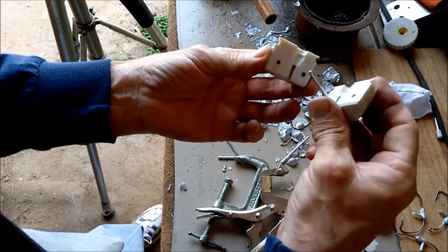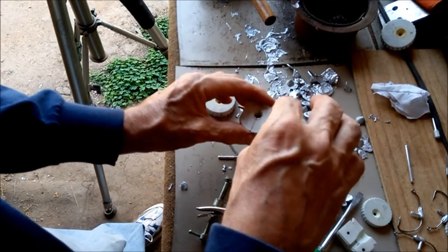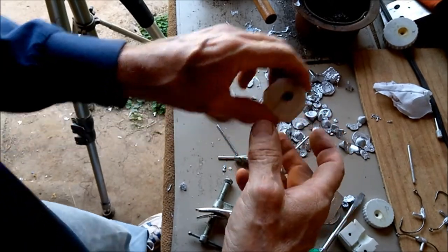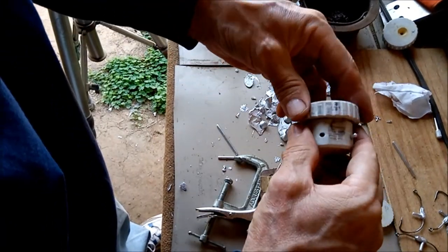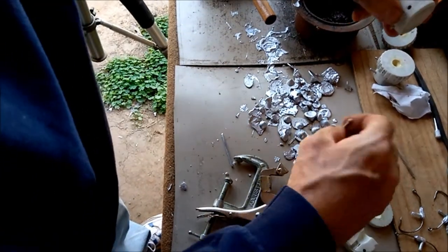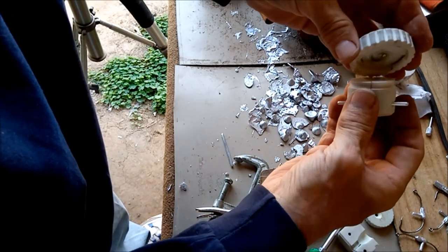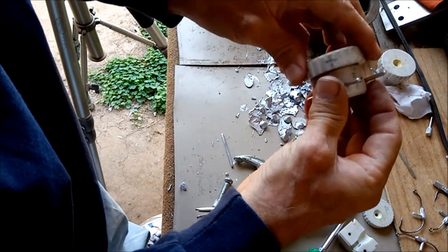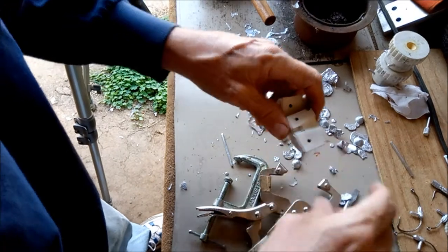The hollow-pointed 9mm showed striations on one half while the other half was good. I think if I'd stuck to my original plan of placing the mold flat and pouring flat, the lead would have dropped straight down and maybe mitigated that — but it's something to work on. My reason for doing this was to show everybody that you can cast bullets using 3D printed bullet molds. Even though the first few iterations didn't give perfectly symmetrical or surface-finished bullets, the fact is I was able to cast bullets with molten lead using 3D printed molds.